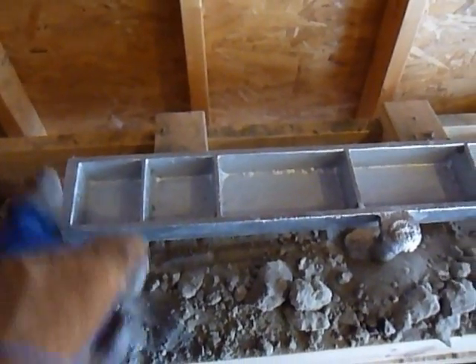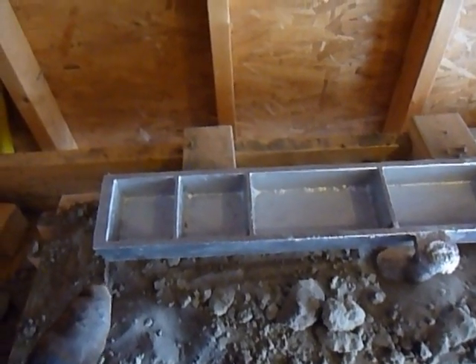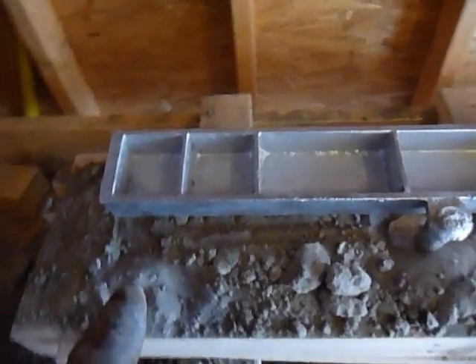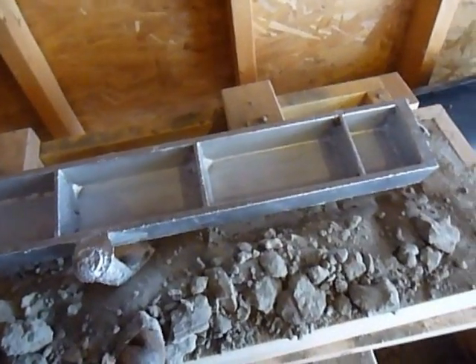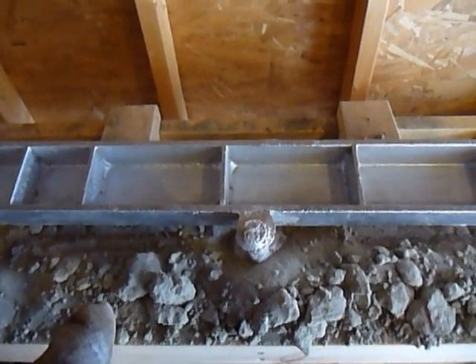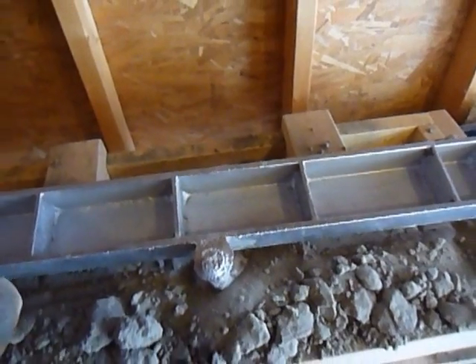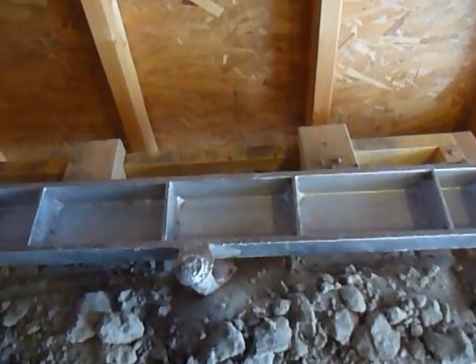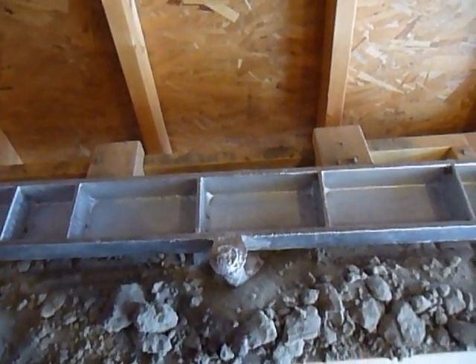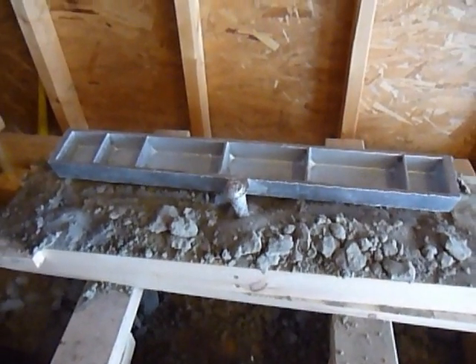This will be for the headstock. I made the headstock foot twice as big as the tailstock foot to match the actual headstock, as was suggested by some people online. So basically it's very similar to what Gingery had in terms of size. I tried half an inch for everything but I didn't have enough metal in the pot — I only have a 1.5 quart cast iron pot — so it worked out really well for this.